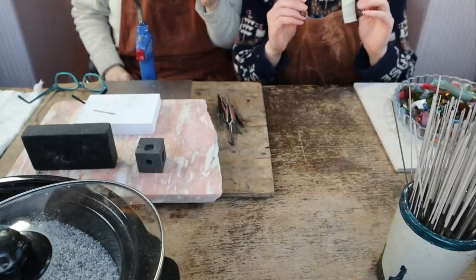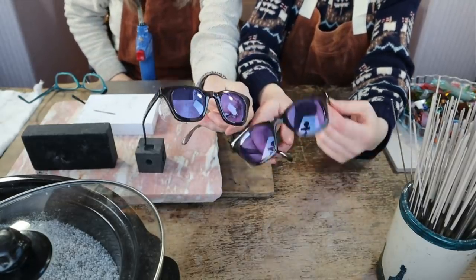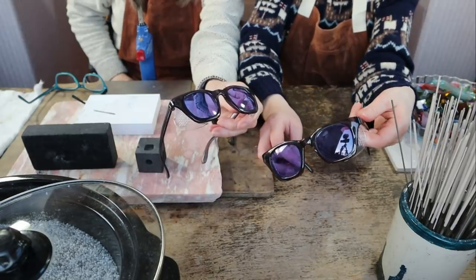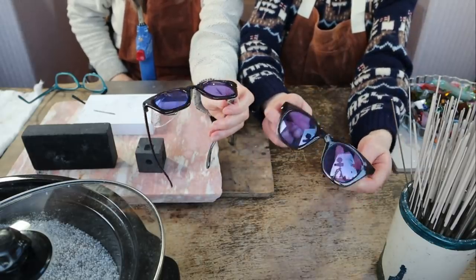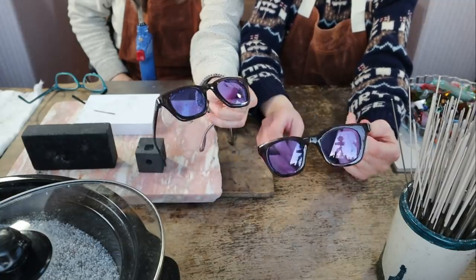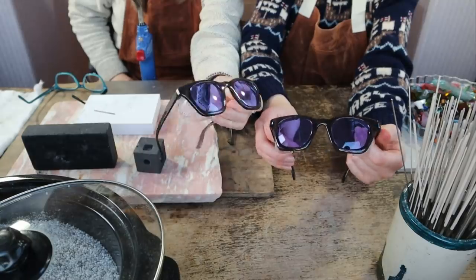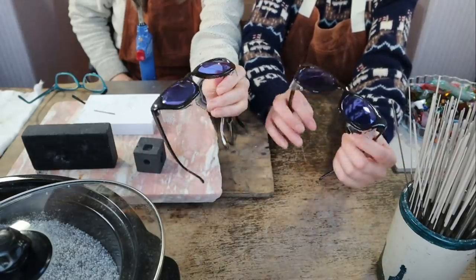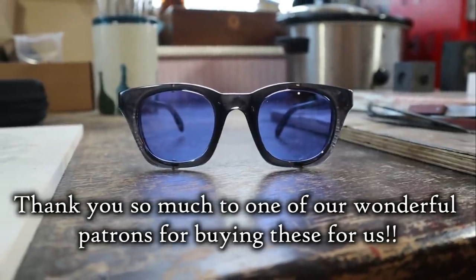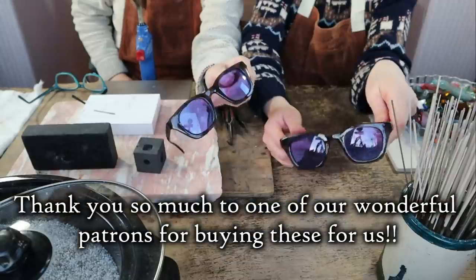Okay, so we're going to put our safety glasses on. What are they called? I think they're called didymium. Yeah, didymium. Something like that. Glasses, or sodium flare glasses, which are going to protect our eyes from the sodium flare, from the flame, and they have UV protection as well. So yeah, it's important to wear these. General safety glasses as well. Things can't get in the sides. So it's all good.